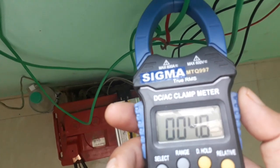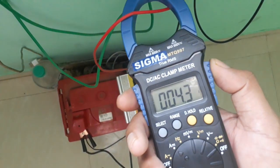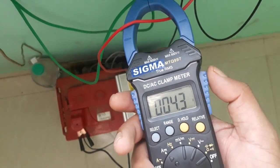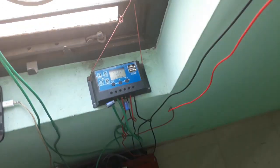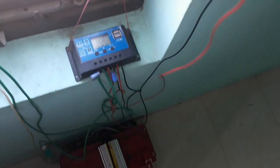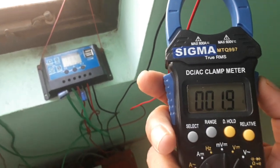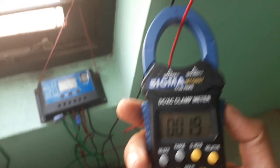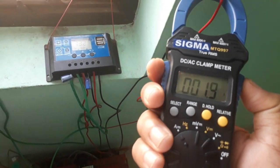It is near about 4.5 amperes. Now let me turn on the fan so you can see the load. The DC fan is taking 1.9 amperes. It is consuming near about 2 amperes, so it is approximately a 24 watt fan.